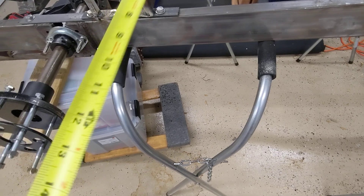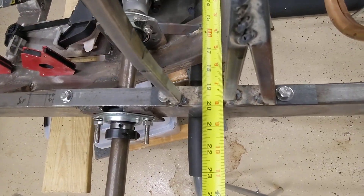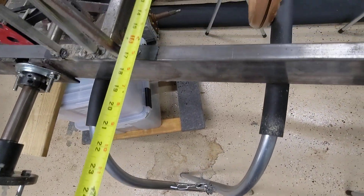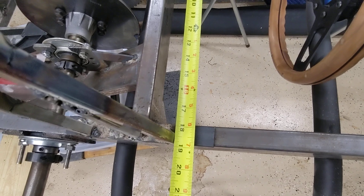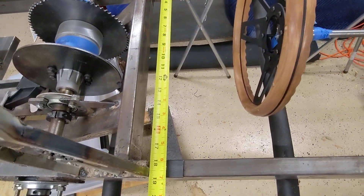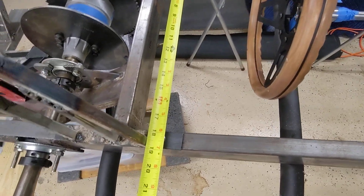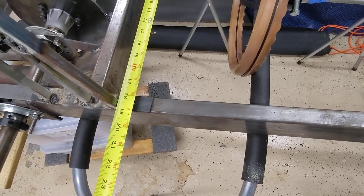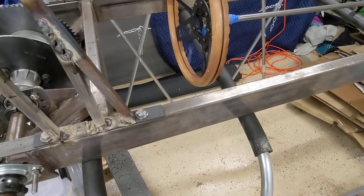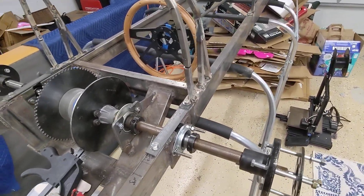The next big measurement is right here at the seat. The seat is 20 inches exactly, which means your internal size is going to be 18 inches. I had one guy saying, 'Why is this thing so narrow? You're going to barely be able to fit in there.' An average chair is 18 inches wide — if your butt doesn't fit in a chair, you're going to have problems on the cycle cart.